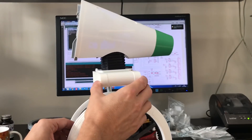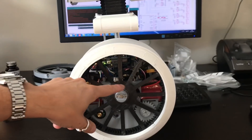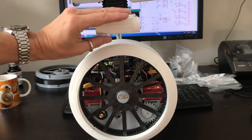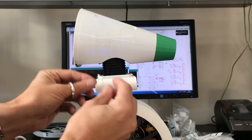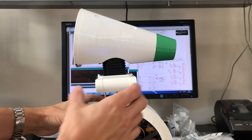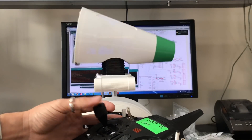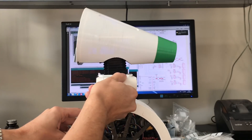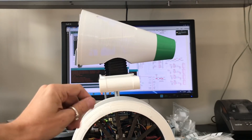Another thing I need to address mechanically is the way the head pitch is held onto the servo down on the body. The servo is inside here through this axle and it's joined to the head pitch motion via a double clamp. I think the problem is that because the shaft is only eight millimeter, the clamp isn't really biting down on enough material to create enough friction to stop it from moving. Right now you can back-drive it over the clamp as you move the head around, and after a couple of goes the clamp will lose position. I'm either going to have to pin that, or find a way of producing more friction — maybe a double nut and bolt on the clamp.